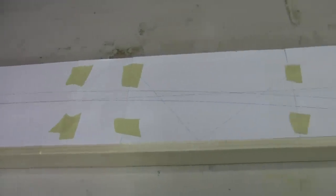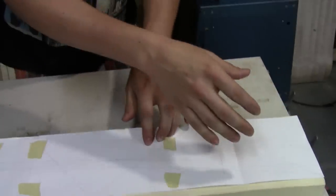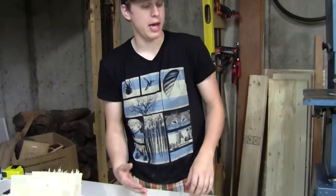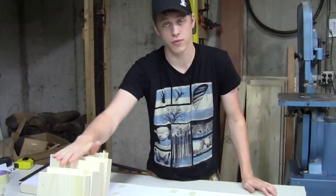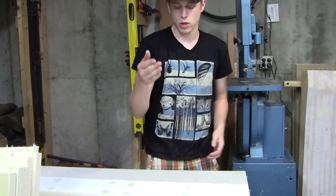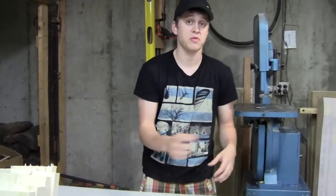Here is the design for the new board. As you can see, this is what is going to be the camber of the board, and we are going to build in concave by varying the heights of our different 2x6s. We have both the top and bottom of the press here.